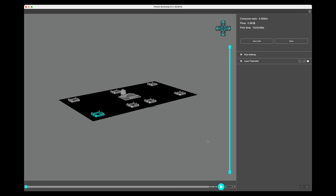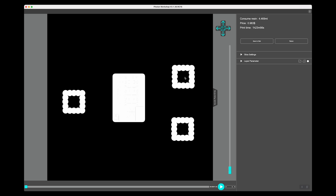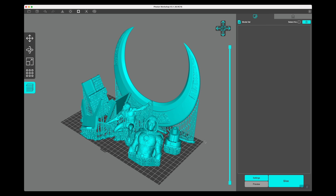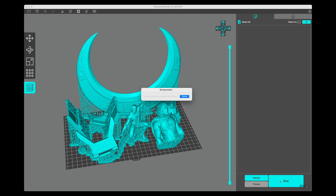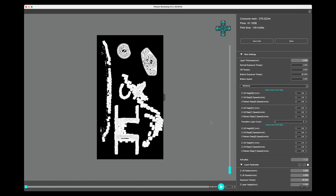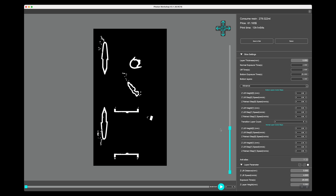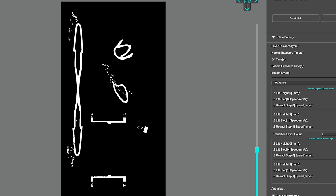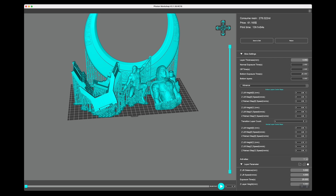I should also mention that I sliced everything in Anycubic's Photon Workshop slicer. The printer itself isn't available to be sliced yet in Lychee or Chitubox, but I'm assuming that will be coming in the near future with software updates. The same thing is more than likely going to happen with the other new resin 3D printers recently released by Anycubic. Photon Workshop for the most part has worked really well and seems like a big performance improvement versus previous iterations. It sliced very quickly with no issues handling most files. I did still run into some artifact issues with my prints because I sliced them in Photon Workshop — I don't see these issues in Lychee or Chitubox. I would highly recommend doing all your hollowing and supporting directly in Photon Workshop and not using pre-supported files like I did here.